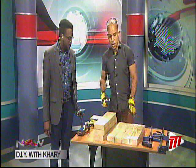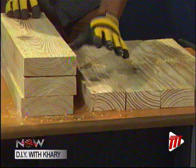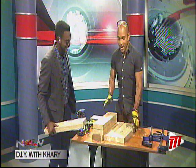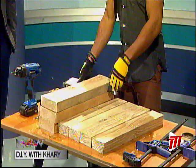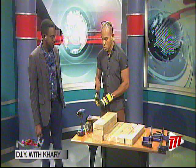Today you're going to need seven pieces of lumber, and those pieces are all two feet. These that you're seeing here are two by four pieces - these are dressed already. And we also have some two by six pieces, also cut to two feet in length. Those are all the pieces you need, and then you're going to need some heavy screws - three-inch fine thread screws.